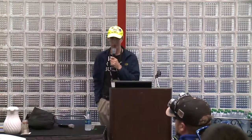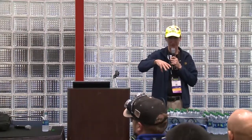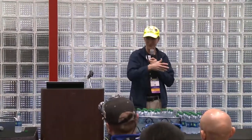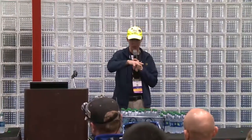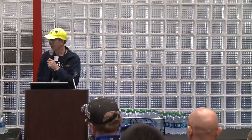Even though these balls are pretty slippery, at Kettering we do a robot in 3 days, basically 18-hour days. We did it in 2.5 days, actually. We hopped the balls up and put them in a container, and they did not all want to go in the same place. They jam, and the friction between the balls made it so they would not move into our shooter, our manipulator, to bring it to the shooter. So we had to readjust and put on some longer tentacles to move the balls more. So grip can be very important, either more grip or less grip.